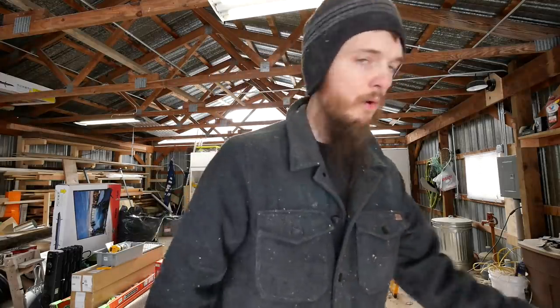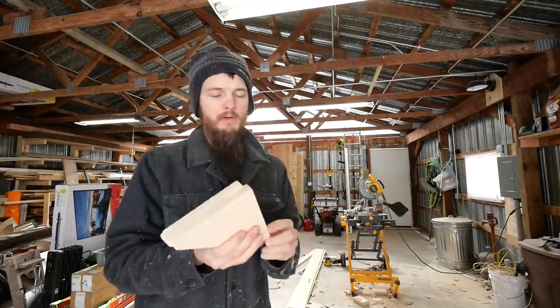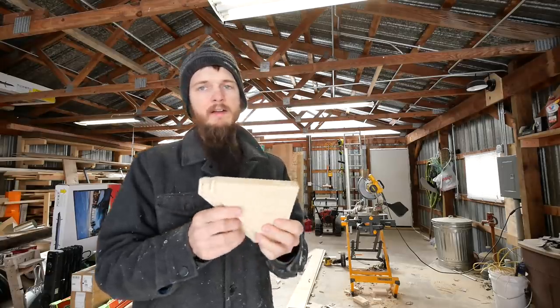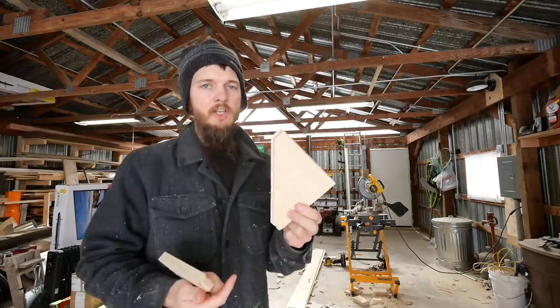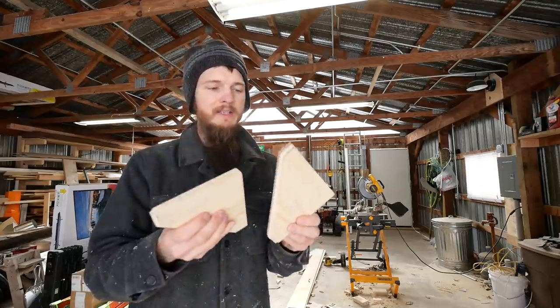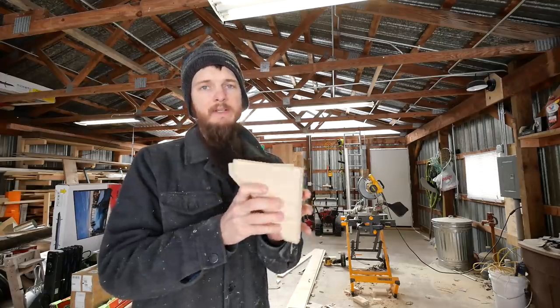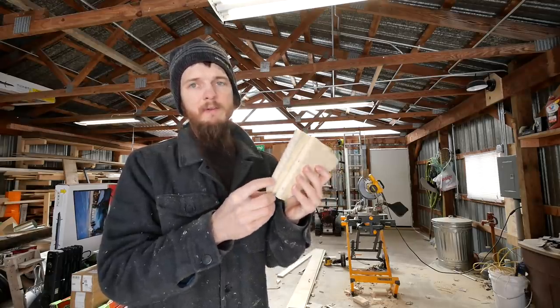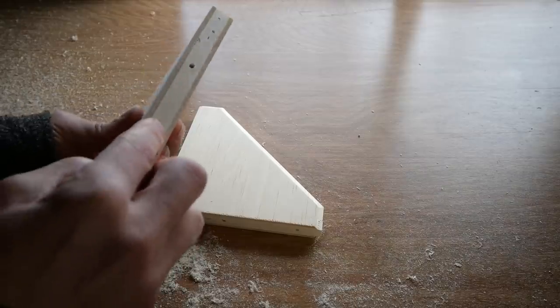It's the next day — I let this glue dry overnight just to be safe, and these are done. So let's look them over before we put them in. We cut out some shelf brackets from scrap lumber — this could literally be any shape or size, I just wanted to keep it simple. I did make a little decorative edge on there. The main thing I'm experimenting with is this hanging system — it's basically a built-in little mini french cleat system.